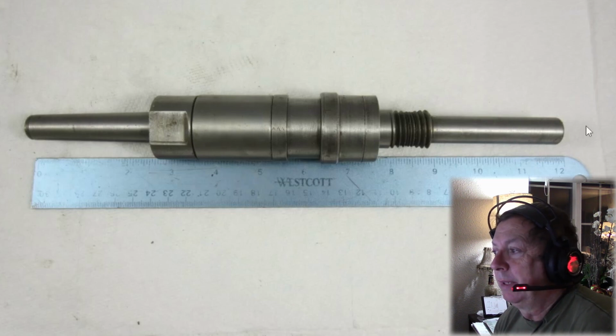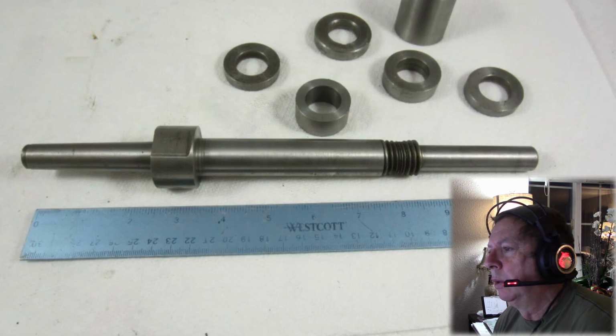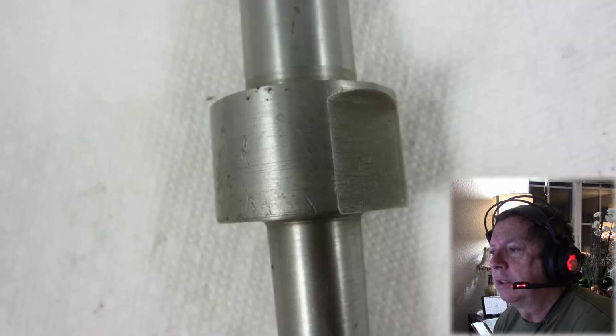Spacers, this either was designed to fit something else, or it's all been shop built. Arbor spacers, different thickness or different outer diameters, that type of thing. Doesn't really matter in that respect, but this is probably something that I would avoid for the $200 starting asking price they're asking for it. Now this may have been a manufactured arbor for something else and it's been modified to fit on an Atlas, or maybe it's just being sold as an Atlas and it was originally designed for something else.